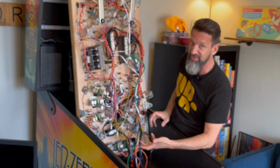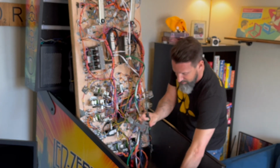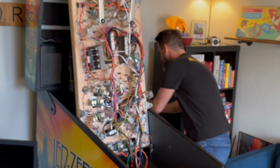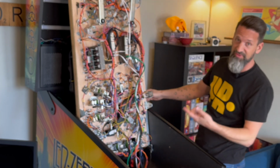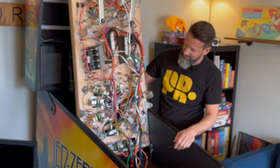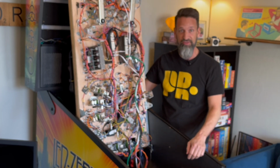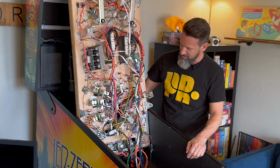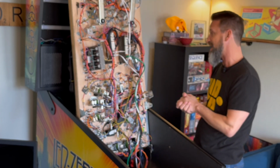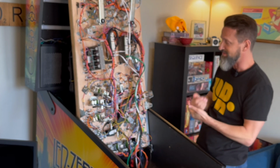Like I said, all the initial testing was working great. And that removes the need for this switch that constantly is getting bent, which also, every once in a while, when I was testing, the stepper motor would go backwards, try to reset itself, and snap off that piece of metal. Well, now there's nothing in the way, so the stairs can do whatever they want, and it doesn't break my homing switch whatsoever. And I've been able to dial this in more accurately than I could with that. So it's very precise. It's either blocked or it's not.